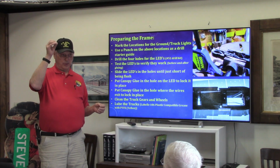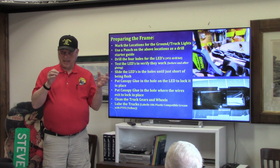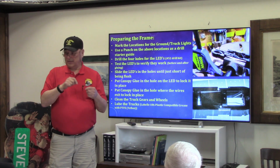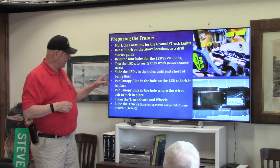So anyway, I go about a 1/4. As soon as I felt the slightest resistance, I pulled it up, and you had to literally stop the drill and pick out with a pick to clean the flutes. But eventually I got through all 4 holes.